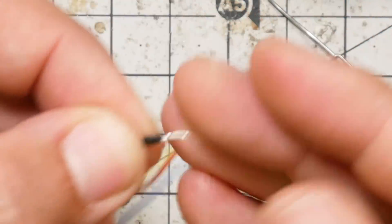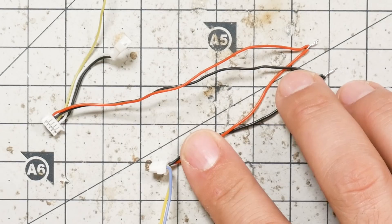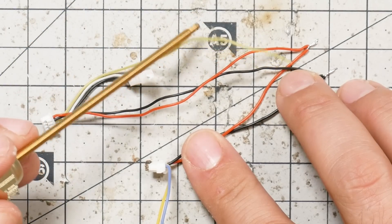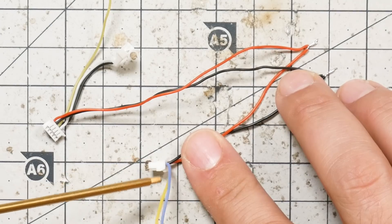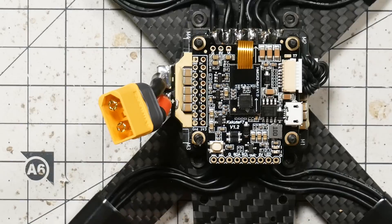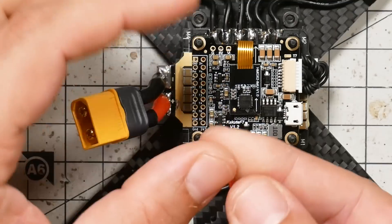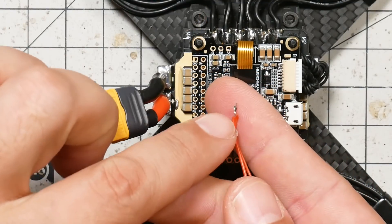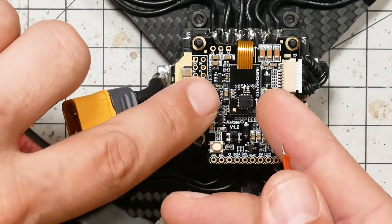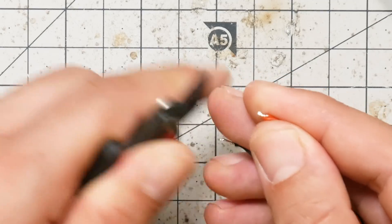Here's what we've got: the camera wire harness with the yellow wire just dangling free and tinned, and the video transmitter wire harness with a blue and a yellow wire. The red and black wires from both are combined. We're going to start from the top and work down so the wires move out of the way as we go. This wire is probably a little longer than we need, so I'm going to shorten it to about two millimeters — and I'm not going to snip it over the board because the little bit of metal that goes flying off can get into the board and cause problems.